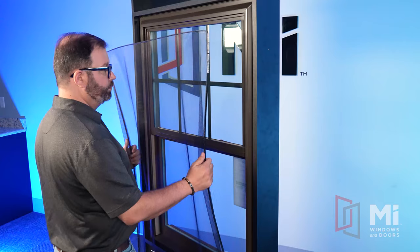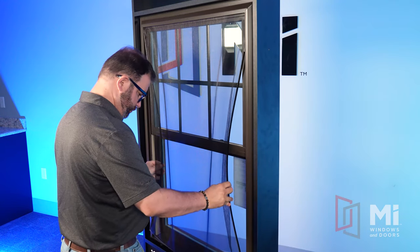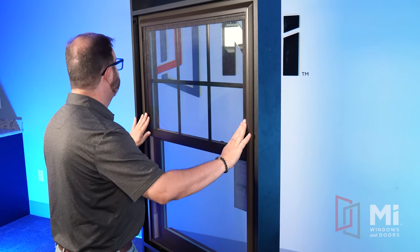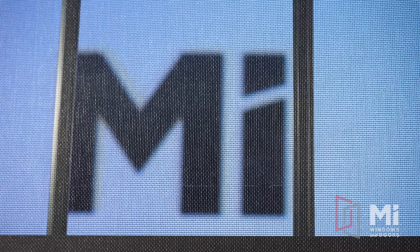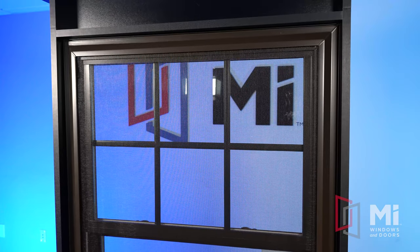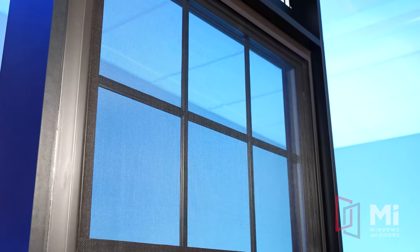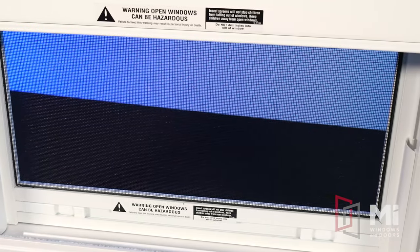Additionally, extruded full screens are available for those who like to cross-ventilate, pet owners, or parents with young children who want to ventilate through the top. Flex screens are standard on painted double-hungs with an optional upgrade on standard colors. The flex screen is barely visible, so you don't need to sacrifice the beauty of the 1650 or the outside view for the functionality of a screen. Its simple design makes it easy to install and remove while keeping it concealed in the screen pocket, making it the ideal upgraded screen. The flex screen is available in a full and half screen. MI's other double-hung series also offers budget-friendly screens, such as non-latching extruded screens and roll-formed half and full screens, with a variety of screen mesh available.